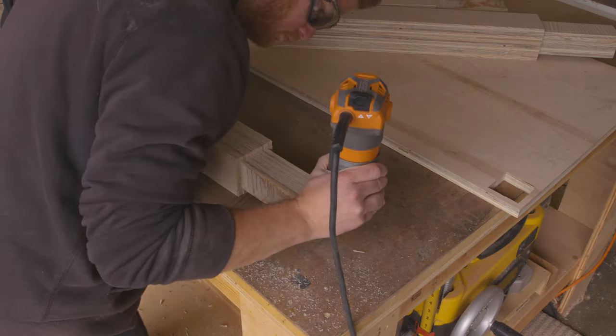Because they aren't structural or weight bearing, I wasn't worrying about using dowels on the top rails and decided to just glue them in. I wanted the rails to be right in the middle of the posts, so I used my combination square and set it to the width of one layer of plywood, then used that to inset the rails from the outside of the posts. I glued up the first three rails, let them dry for a few hours, then glued in the last rail and set the bed aside.